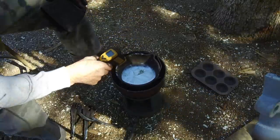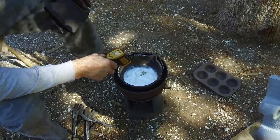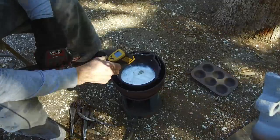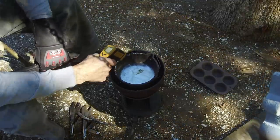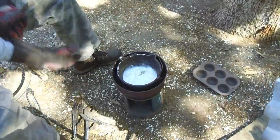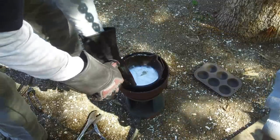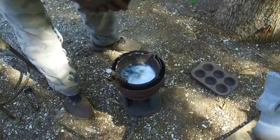I went ahead and picked up an infrared thermometer. When you point it at shiny metals it doesn't always get you the exact temperature because the reflection isn't right off of chrome-y metals — I'm getting about 270 degrees Fahrenheit there. But if I put it right on the barrel or the bowl next to it, I got 650 degrees Fahrenheit, and that's a pretty good temperature for working the metals in liquid form. That coincides pretty much with the manufacturer's temperature on their chart for working with it.